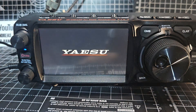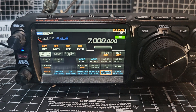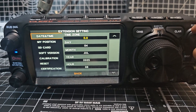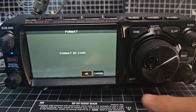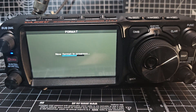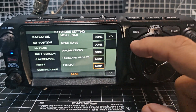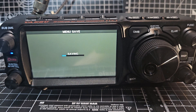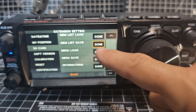If you've never done this before, it normally comes up with a message like 'set up.' Press and hold the function key, go to Extended by using the back and forward buttons, then turn the function knob down to SD Card and select Format. Click OK — I've got no memories I value, so it formats. That should make it ready for your PC to recognize the files. I'm going to save something: go to Menu, Save New, then Enter. You can see it's saving. Tap the screen to go back. Then go to Menu, List, Save — you can do the opposite too.